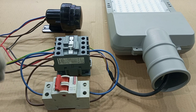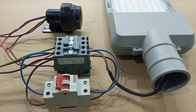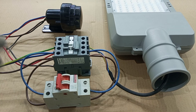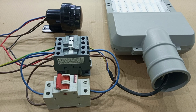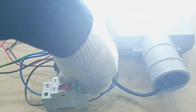The important thing to note is that this bypass wiring is only for temporary purposes. During the day, we can use it for inspecting the system, and when the photosensor fails, we can temporarily use it until we get a replacement. The bypass switch should always be at the off position, except when you want to bypass the system. Just after you are done with whatever you need to do, it should go off again. We can simply bypass the photosensor by switching on this switch.